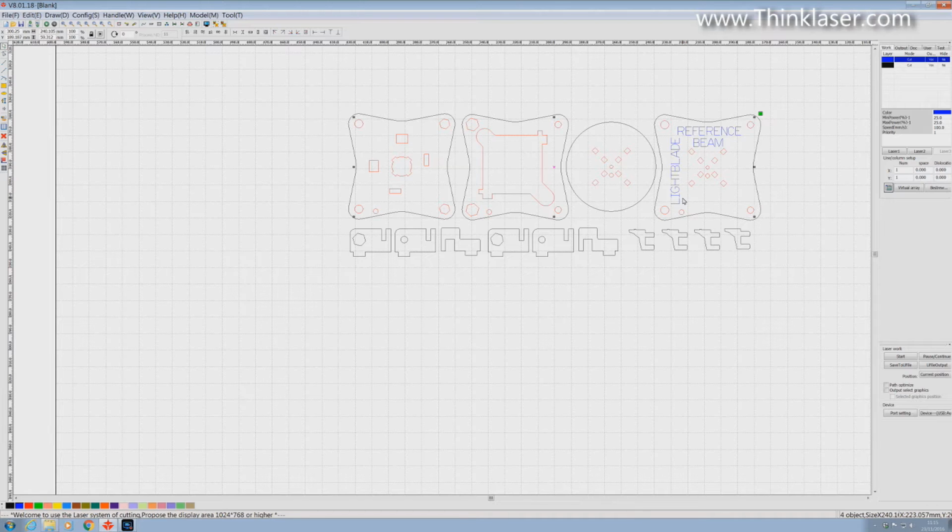In this instance, I don't think it would have made any difference at all, because it's a very small project. But in general, try and cut your outside shape as soon as you've cut your holes. That way you will have no misregistration possibility between the outside shape and your holes. If I do this pattern here and then move off and do all sorts of other things, there's always a risk, a very low risk, but there's always a risk that by the time I come back to cut this shape, the holes may well have moved very slightly. Most of the time it doesn't matter, but on certain key jobs like this one, it would matter. So as a general practice, I would advise cut the holes first and immediately cut your outside shape.